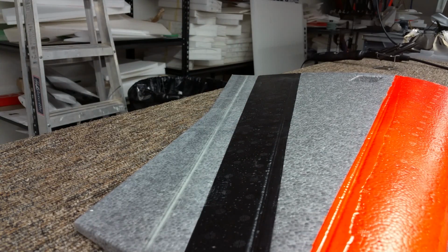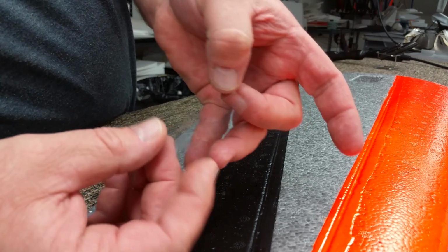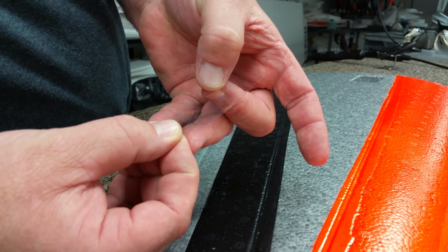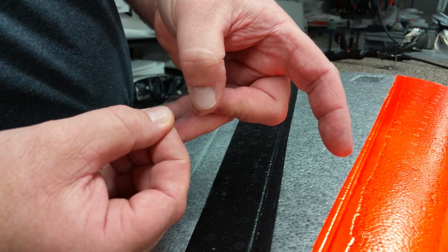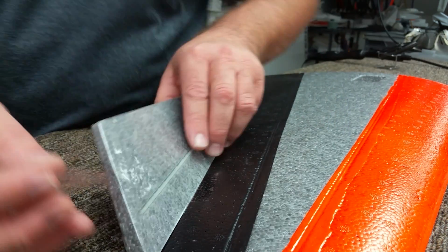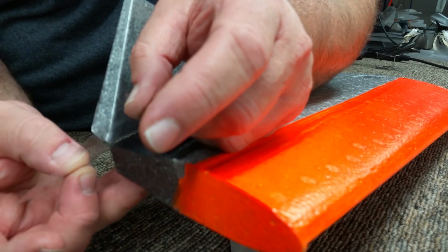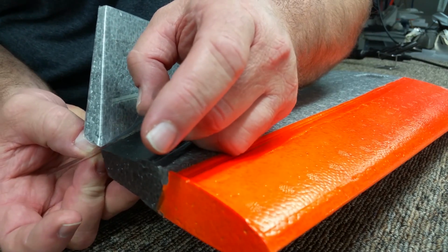And what I'm doing here is, to get this straight and get this started, I have some tape pulled off the edge of the table here in some lengths, and I'm going to do what we call a Z-hinge. On a Z-hinge, we take the tape and overlap it by about 3/16 of an inch. Actually, not even that. More like just under 1/8 of an inch, or say 2 to 3 millimeters. And when we do that, we slide the tape in the gap. The area that is overlapped stays in the gap underneath the bottom of the plane in the hinge area.